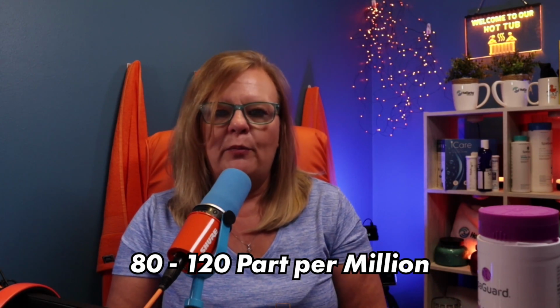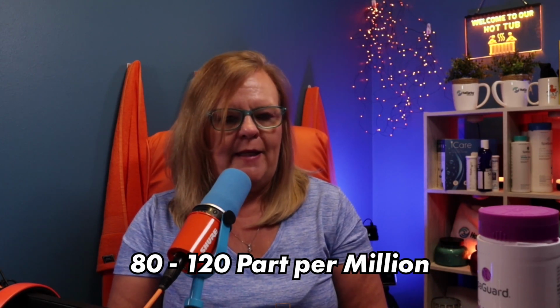So the first thing that you need to do when it comes to balancing your hot tub is you are going to balance your alkalinity. Super important that you get your alkalinity balanced first. It's going to be 80 to 120 parts per million is where you want your alkalinity to be.